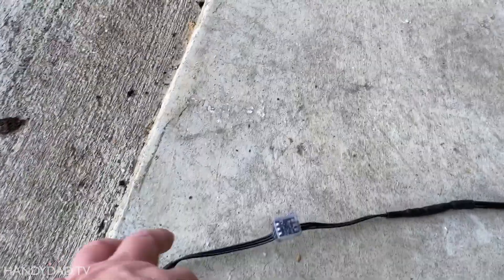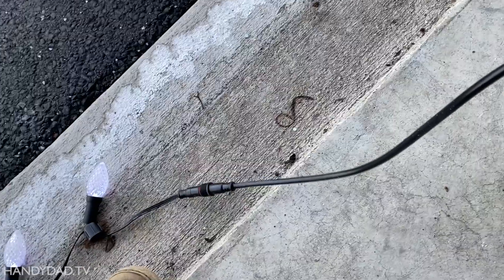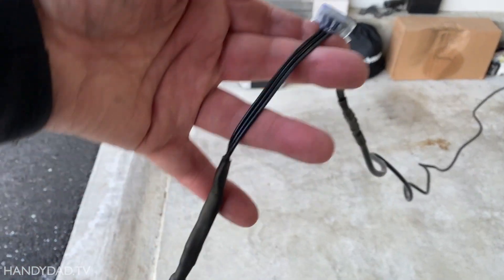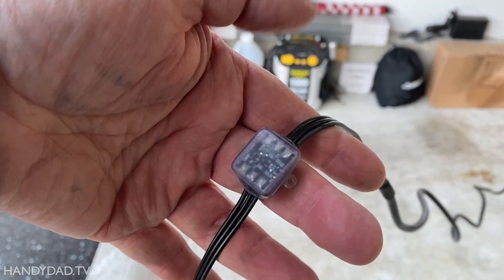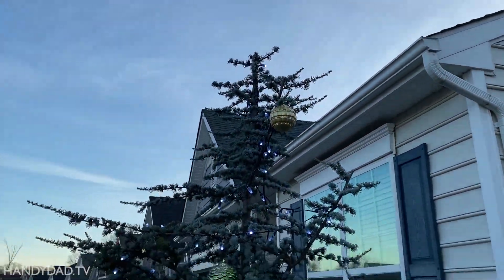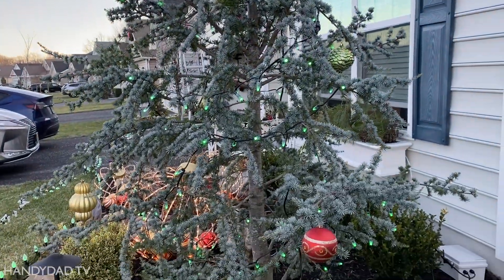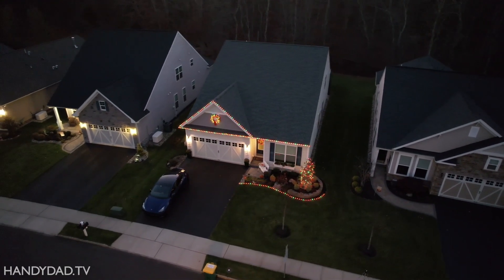I also have this F-amp that I put in line — it's a booster that was needed to get the signal from the end of the string over to the wreath. I put these in with waterproof connections, and it was exposed in the weather in the gutter and it worked fine. On this Christmas tree, which is about 8 feet tall, I put three strings — that's 150 pixels — and that was the perfect amount. It just looked really good for an outside tree.